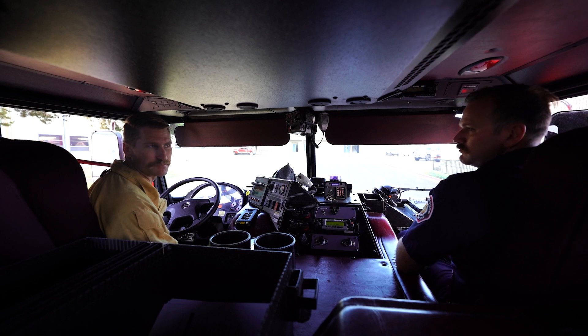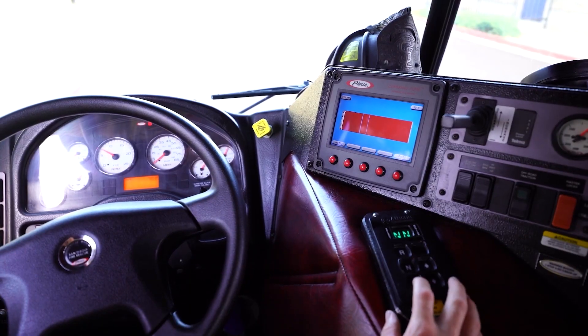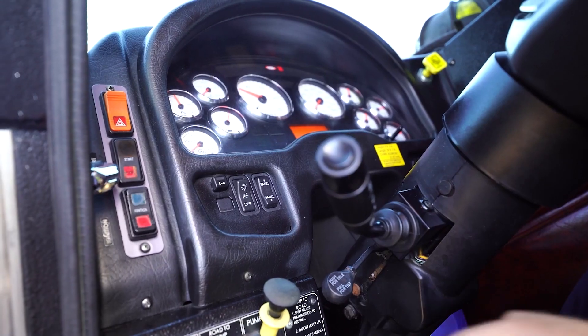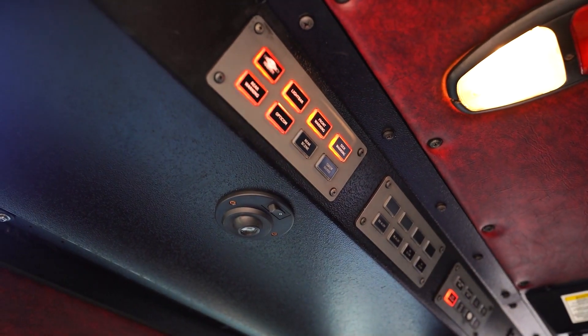The candidate must ensure they are wearing the proper PPE, not wearing a helmet in the cab. Check for crew and apparatus security, ensuring everyone is seated and seat belted in the cab, and that all compartment doors are closed prior to moving. Turn on all emergency lights including headlights. Once the spring brake is released, check the door and seat belt warning lights.